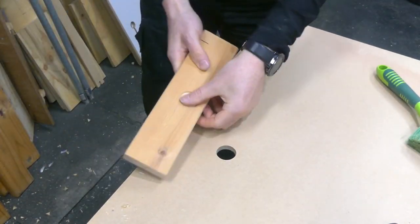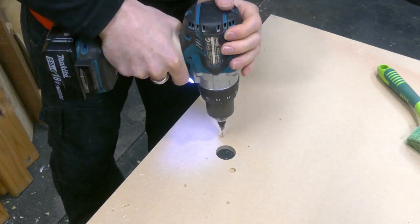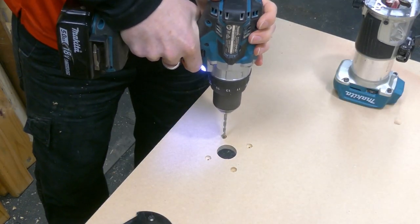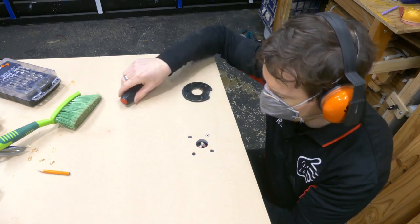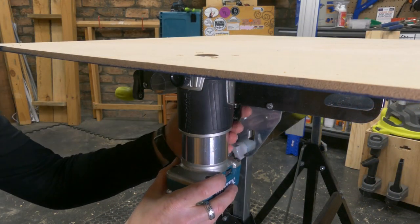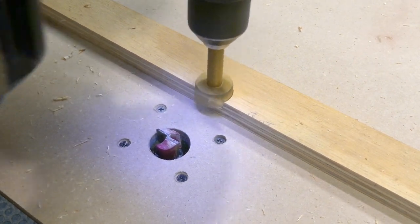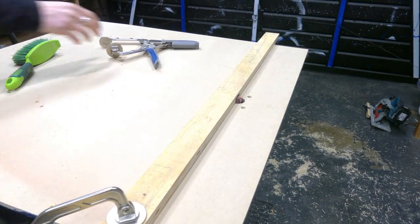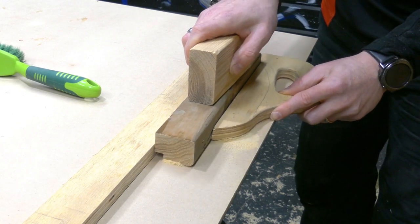A backing board can help with this. Use the router base to mark out your holes. Drill some countersunk holes that are going to reattach the router underneath the table — you'll probably need to clear these out with a slightly larger drill bit to make the machine screws fit. Get your router, pop the screws back in and hand tighten them into position. Set your depth with the new router bit and we're halfway there. The router table is most useful if you have a fence — grab another straight piece of plywood or any other very straight timber, use a Forstner bit to make the appropriate size clearance hole for your router bit, clamp it down on both ends and you will be routing away in literally minutes. It's quick, it's crude, but it will work.